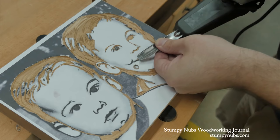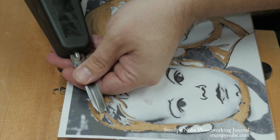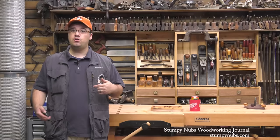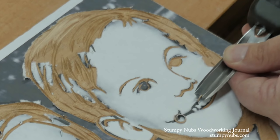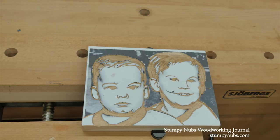It's important to remember that any parts you want to be dark in the finished project have to be carved below the surface. You don't want to go too deep, but if you only scratch the surface, you'll likely end up sanding those marks away when we finish up. I also went back after digging out large dark shadows in the hair and used the V tool to add some individual hairs at the bottom of those indentations. Even though those lines won't be a different color, they'll give the carving added depth and help show the direction the hair is flowing and where the part is.